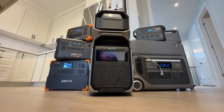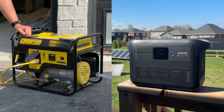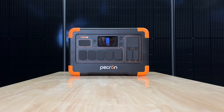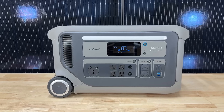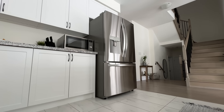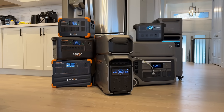The only other thing to consider that no one else really talks about is idle consumption. Every power station and gas generator use energy just to be on. A gas generator will consume gas when running even if you don't have anything plugged into it, and a power station will consume battery just being on — idling, waiting for you to plug something in. So you don't actually just need a 1,300 watt-hour battery bank. You need to know the idle consumption of your power station to make sure that with the loss from idling plus the power the fridge takes, you have enough. Today we're going to cover a couple different timeframes and units we'd actually recommend, including idle consumption factored in.